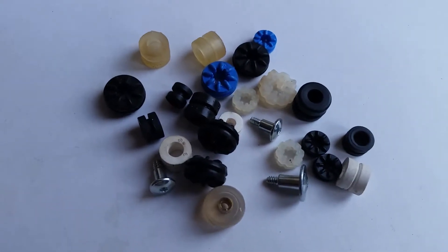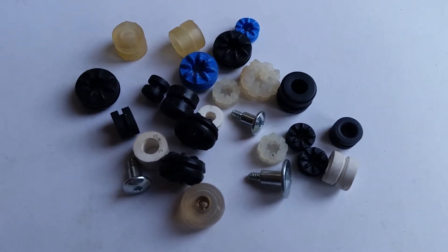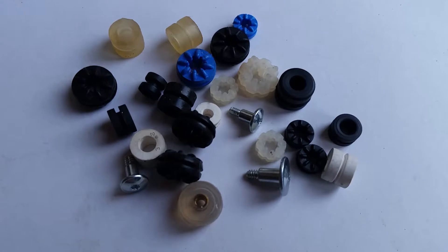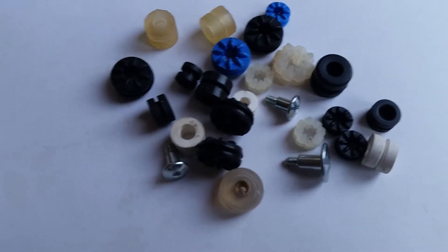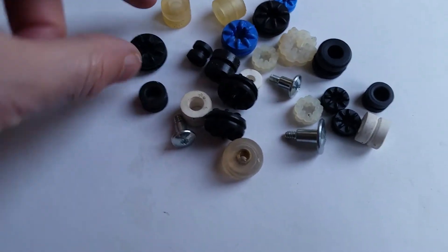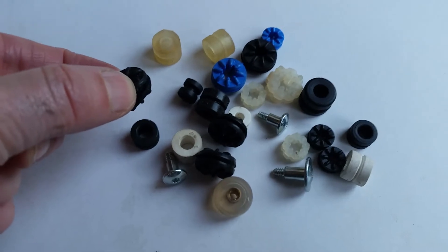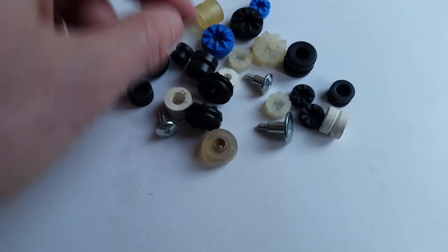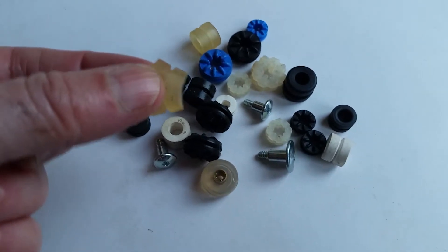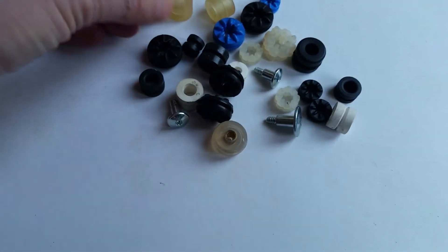They're good for isolating fragile equipment from shock and vibration, for loads under a kilo down to a couple of hundred grams. They usually come in a highly damped thermoplastic in Shore 40 to about Shore 60, or we have a range of highly damped gel grommets which are very soft and can handle very light loads.